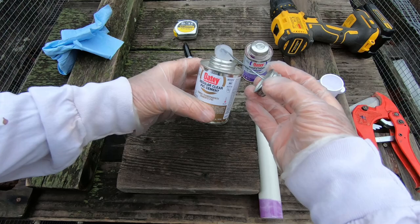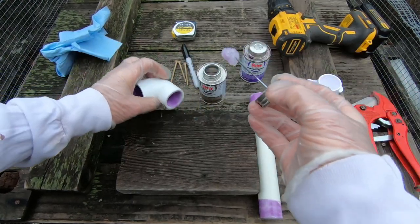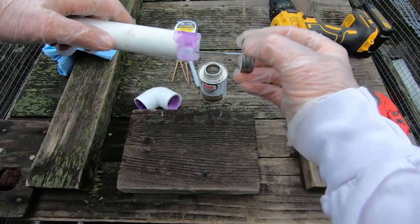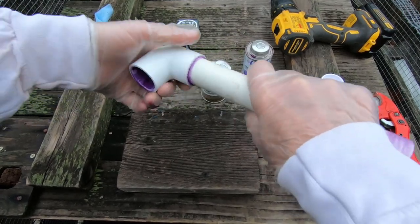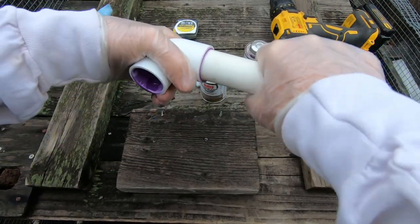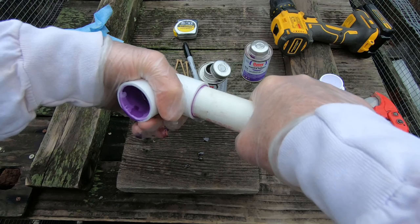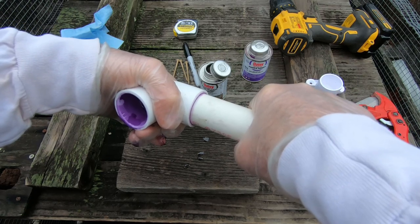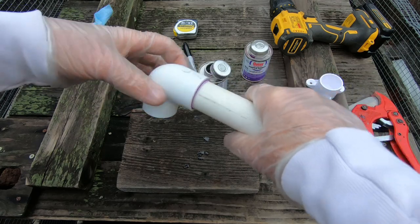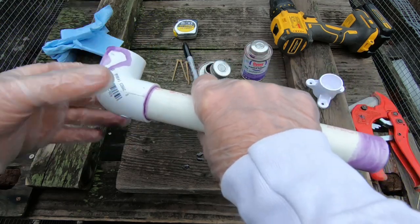Then you have your glue — it is PVC cement, nothing fancy. Just put it in the inside of the elbow, get some more, put it on the outside of the pipe. This little circular motion is the best way to put it on. Then within less than half a minute you want to put it together and twist — that distributes the glue all around and makes a nice good seal. We are not trying to handle high pressure water; we want to keep water out and prevent it from accumulating in this pipe. So some of it dripped down — I usually like to put a piece of scrap wood down so I do not drip it on something I care about.